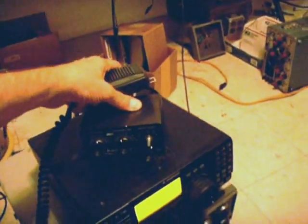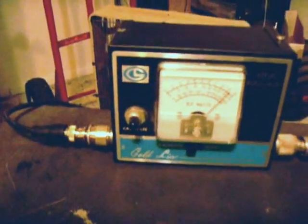Now we flip the tuner into position and plug the key relays back in, and we key it again. Wow, it goes way over — you can at least get an idea of the difference. The SWR going back into the rig looks pretty darn good, probably about 1.3 to 1. I could trim it back a little more, but actually it's very good.